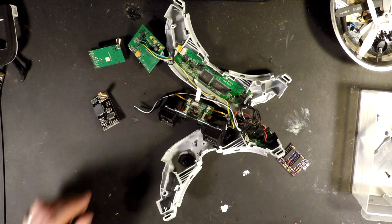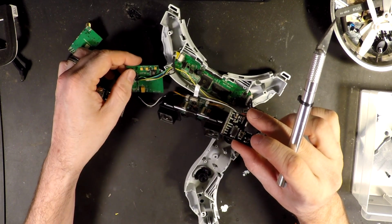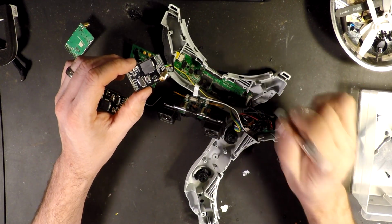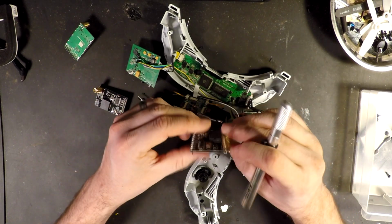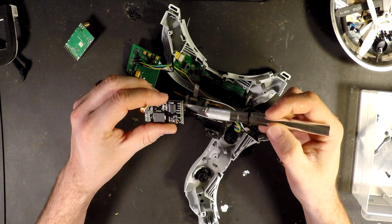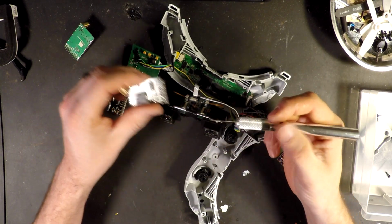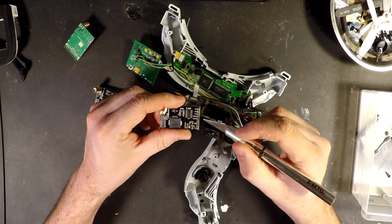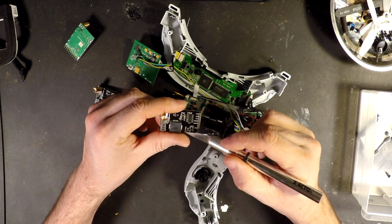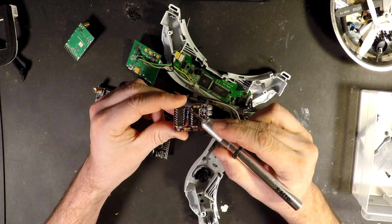So now, the next thing we would have to do is, like I said, we had the cables soldered into the back of the board, CS1, 2, and 3. They are going to come around through the actual goggles and pop out this other side. That's where I'm putting my second receiver. I'll have to solder those cables, CS3, 2, and 1. So those are just going to have the three channel cables soldered directly onto this board. And then just like we did the first board with the two little cables coming out the side, I've got to solder one on the video and solder one on the RSSI. And then those two cables, the RSSI and the video, will be going to our diversity board to video 2 and RSSI 2.